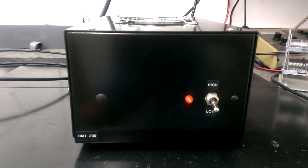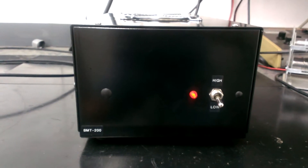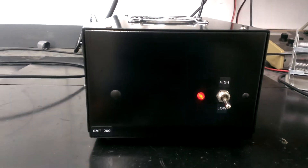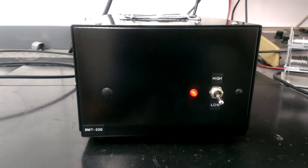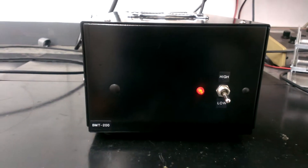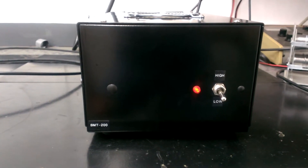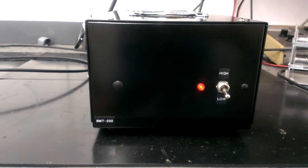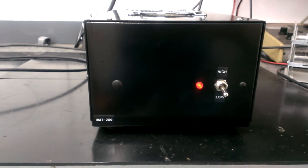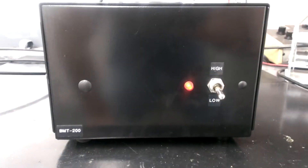We did a video just a few minutes ago on a 2879 box with a regulated power supply. This one's actually got an unregulated power supply, high and low, with a built-in keyer — for keyer amplifiers that need a foot pedal or a key circuit built in. You don't have to worry about all that; you can just run this amplifier and it's got a keyer built into it. On low, looking at about 14 volts; on high, looking at about 17 volts.